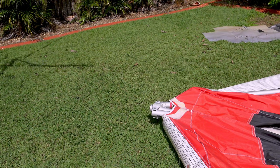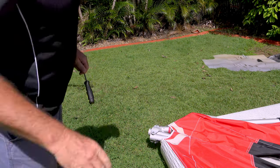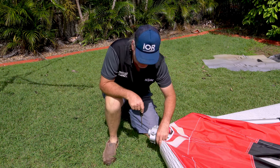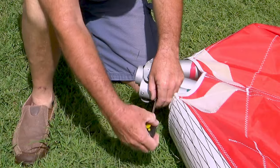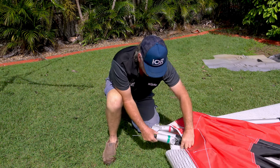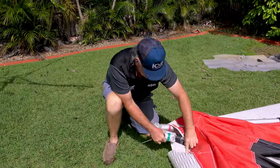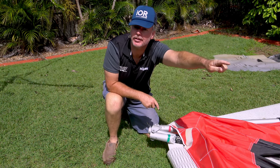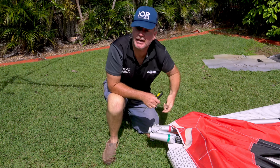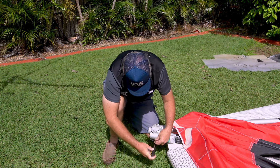In summary, with the wing folded but loose and untied, remove the leading edge tag screws at the nose. When you receive your short packed wing, you'll receive it with this tang under the screw. So you remove the screw — this allows the tang to come out, and you can slide the fabric down the wing. There's supposed to be a tube connected here. Anyway, that allows the wing tip to slide down further as well. By doing that you can then put the wing tip extension into the end of the wing. Once you've done that, you won't be able to put the screw back in, so we'll just keep it safe for now.